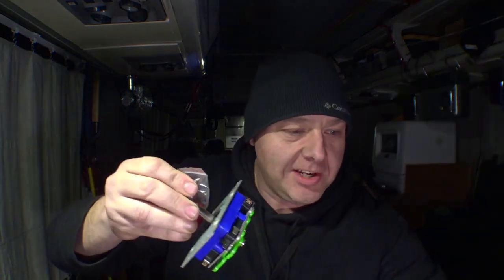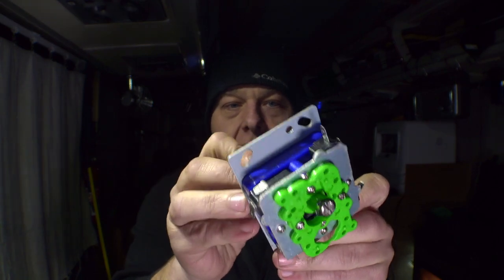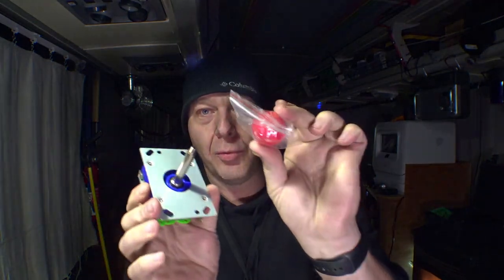I got some parts — this here is a joystick with a bunch of microswitches built in, one for each direction: forward, back, left, and right. It also triggers diagonally, and there's a little red ball to put on there. I've ordered a bunch of parts and I'm finally going to move forward with the R-Net remote control wheelchair project. The reason I bought this joystick is because of the microswitches. I've got a couple of Omnis and an input/output module — I'll probably use an Omni because they're more readily available and around $80 on eBay, as opposed to several hundred for the I/O module.